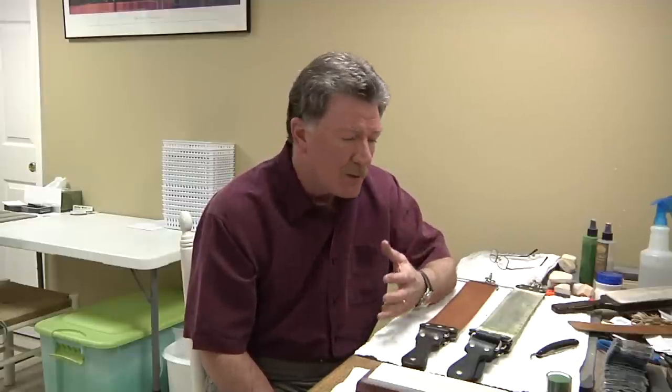The first thing I'm going to do is talk about what I do when I look to refresh a razor. When your razor starts to pull, probably within 2 to 3 months of having been honed, the first thing you can do is refresh that razor with just a few strokes of either chromium oxide, diamond spray, or CBN — some media like that. The pastes are typically better, in my opinion, on the back of leather or on a separate stand-alone strop.